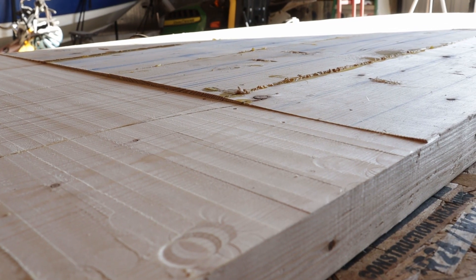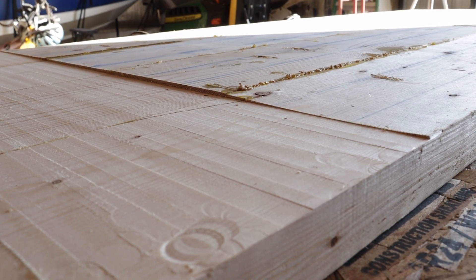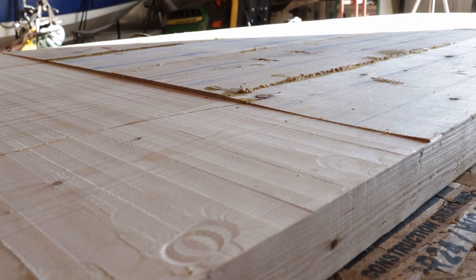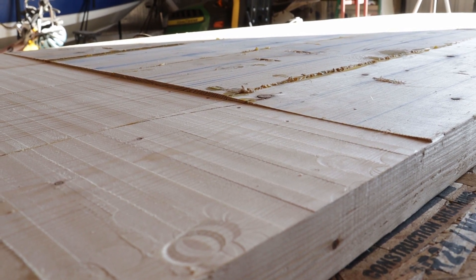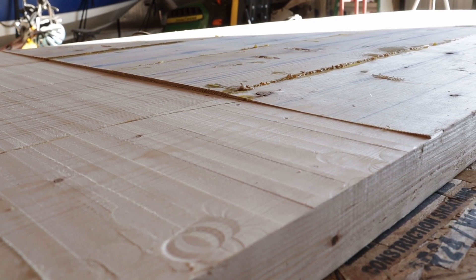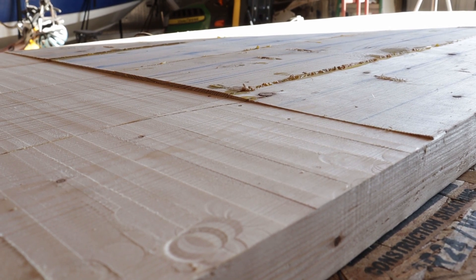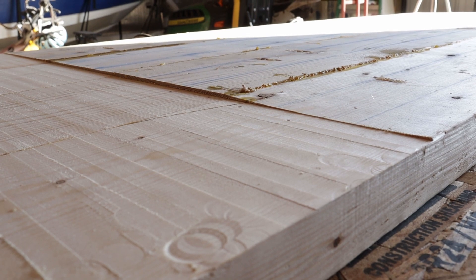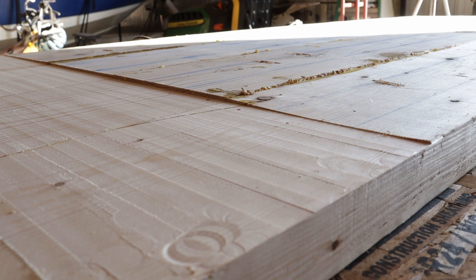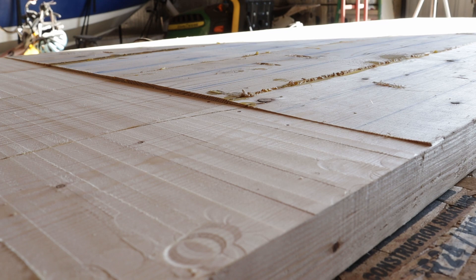See the profile — how it changes. We took only about a 32nd of an inch on the right-hand side, but in the middle that board has a bit of a rise, so it's taking off a bit more there and then tapers down along the other side. We're starting with the back of the boards to get them nice and flat first, before we do the front side — having the back a little uneven is fine since it'll be inside the cabinets and will get routered away anyway.